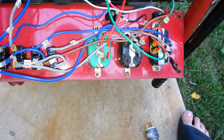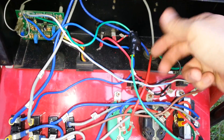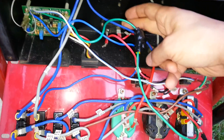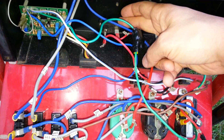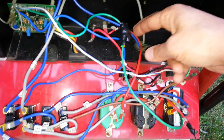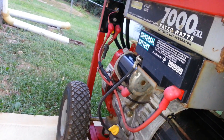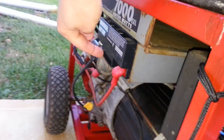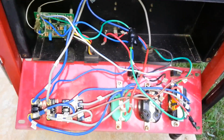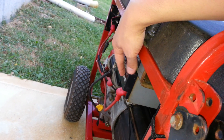This is for your DC outlet — for charging a battery at 10 amps. This is a 10 amp auto-reset breaker, so if you short it out it will pop for a couple of seconds and then re-engage, preventing shorts or reverse polarity issues when charging a battery. This red wire down here goes to your front rectifier. There's also a blue wire that runs to your starter battery through another 10 amp fuse to the starter contactor. Be careful not to mix up those two rectifiers — this one only charges at about 1.5 amps. If you put 10 amps to that battery it will most likely explode.